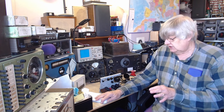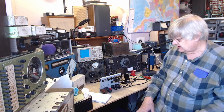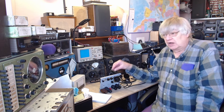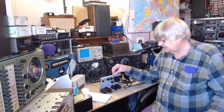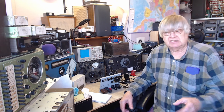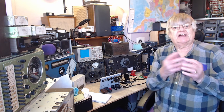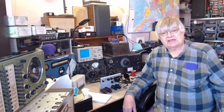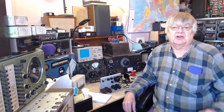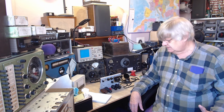I had to order some resistors - the E24 series: 1k, 1.2k, 1.5k, 1.8k, 2.2k, 2.7k, 3.3k and so on. But this set was designed before the E24 preferred values series came along, so it used odd resistors like 75k, 20k, 250k, and 250 ohms. I didn't have any of those. I could have made the values up using two or more resistors but that would have been a mess. I wanted to keep it original, so I ordered the specific resistors.